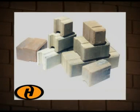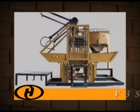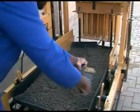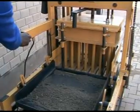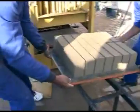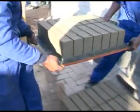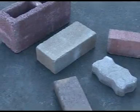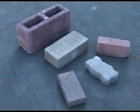This full range of interlocking Hydroform blocks can be made using these machines. Complementary to the Hydroform range of machines is the V3SE Vibroform machine, used to manufacture high quality paving, hollow and stock bricks. Vibroform machines use vibration to compact the sand and cement mixture. Once the bricks are formed, they are moved away and carried on a wooden pallet ready for curing. Vibroform machines can produce a wide range of products, including hollow bricks as well as paving and stock bricks.